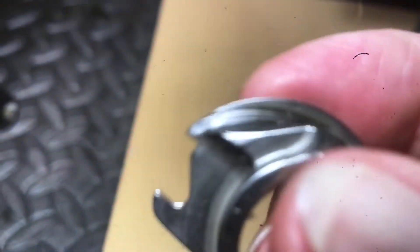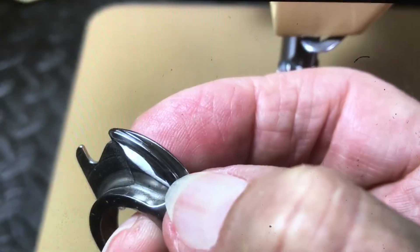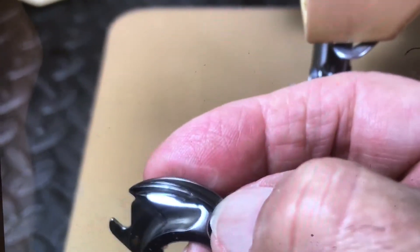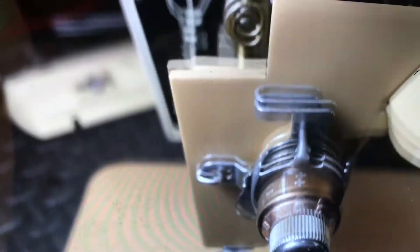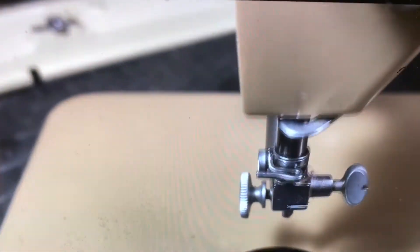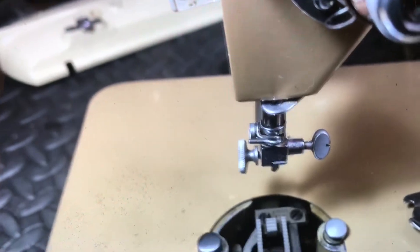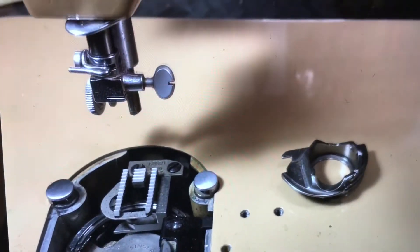What caused it to get wedged inside is this little aberration right here — see that little notch? That is not supposed to be there. That's called a thread abrasion, or thread erosion. Thread will actually erode steel. In industrial machines, thread will cut metal parts in half. Polyester thread especially will cut a groove in steel, and that's exactly what it's done here.